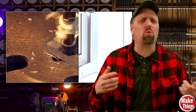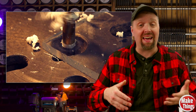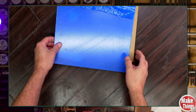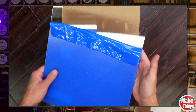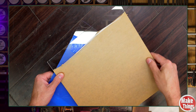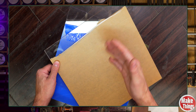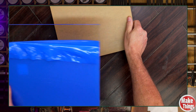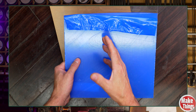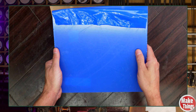It just sits there. But back in the shop you're drilling, mounting, clamping — that adds stress, and this stuff already has a whole bunch of stress baked in. Here's my sheet of extruded acrylic. It looks like acrylic; there's really nothing that stands out. If you compare it to cast, it's hard to make out any difference, which is why it's sometimes so difficult to find the right material in the store. But inside, at a molecular level, molecules have been stretched and deformed as the acrylic was pressed. The plastic wasn't cooled evenly — it's just a mess.